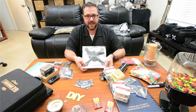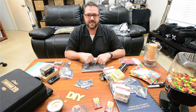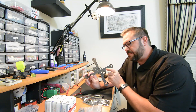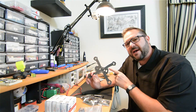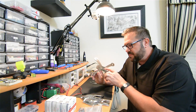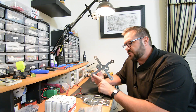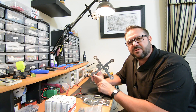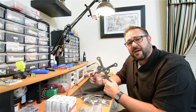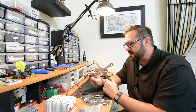There's a lot of complexity, but we're going to break it down and make it straightforward. We're going to build out this frame by putting the motors, ESCs, and power distribution board on it, then add layers — we'll add video, then the flight controller, then button it up and take it out and fly. First thing we're going to do is get the power distribution board mounted on the frame. This is where the battery energy comes in and gets distributed to the rest of the systems. We'll connect the ESCs on each arm, mount the motors with thread lock so they don't vibrate loose, and put caps on all the ESCs to prevent back EMF power spikes and buffer noise in the power distribution center.